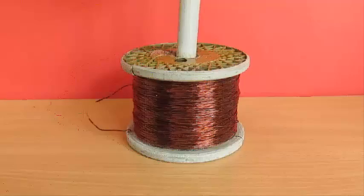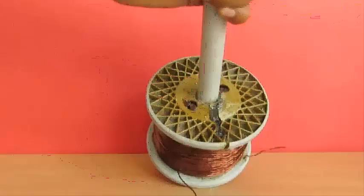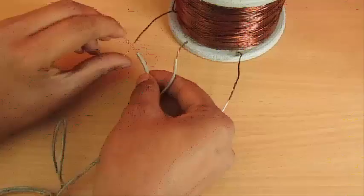This is how you make your primary coil with 2 kg of insulated copper wire of about 3000 turns. In the middle of the coil you insert some metal — iron rods and some nails — to make a strong core. A strong core concentrates the magnetic field inside the primary coil and hence makes the effect hundreds of times stronger.